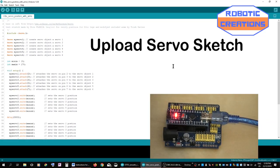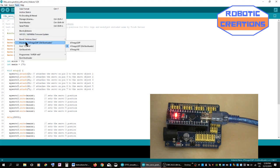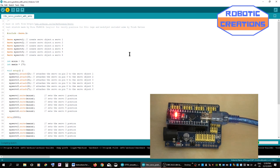I've opened up the Arduino IDE — I'm on Arduino 1.8.9, a recent version. I have a clone board and I'm using the old bootloader. We've picked up COM16, which should be our board. Now what you can do is just upload straight to it — you can compile it, but this has been checked.